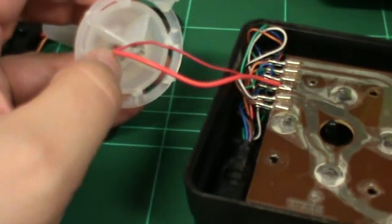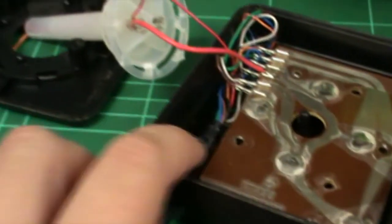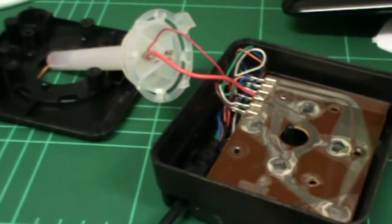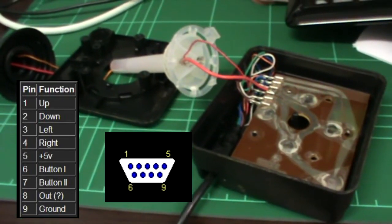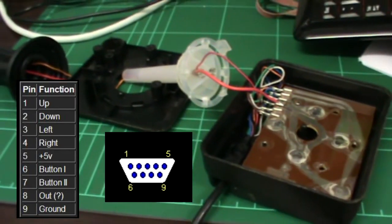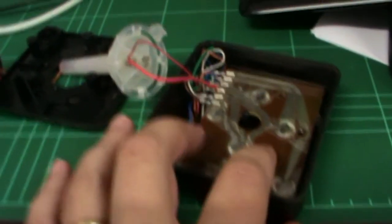The hole was originally there, just made a little bigger for the larger wire, so this wire goes directly to this cable. Where I got this cable from - it was originally an extension lead, which means the extension leads have all nine pins wired. I'm going to do this to one of my spare Wikos as well because it's got two buttons, and see if I can wire that up to be an MSX joystick. This is just my first experiment because I really want to play Vampire Killer - Castlevania on MSX - and it requires a two-button MSX joystick.